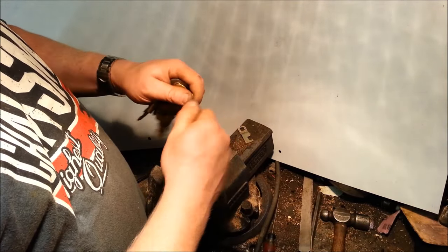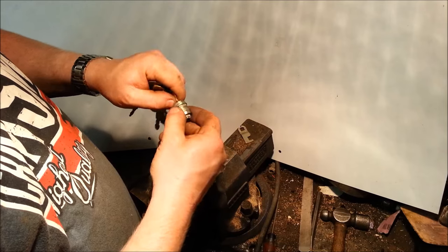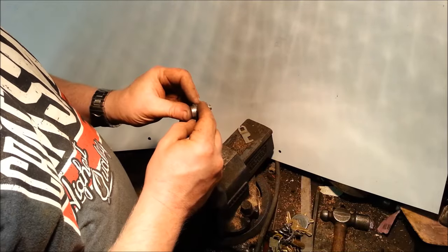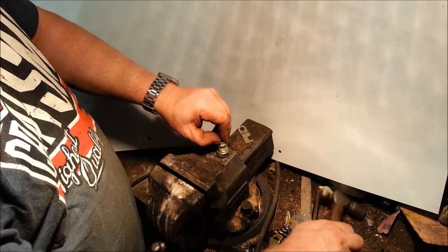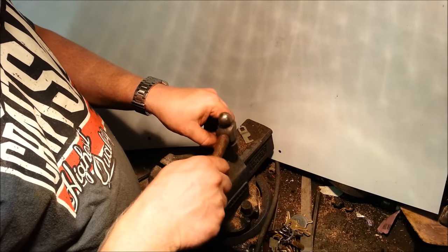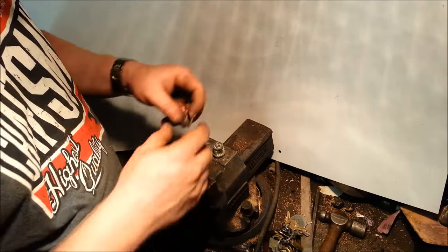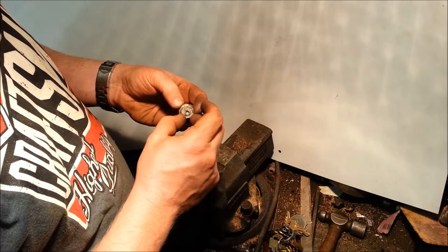We take our cylinder now, put that in, and with my key pushed in I'll spin it a couple times. Key goes in. We will reinstall our front cap — the front cap is back on. Where we bent out the edges, I'll just round that back over and hammer that down. Now we'll take our retaining pin and reinstall our rotation lock — that only allows us to rotate it a certain way.